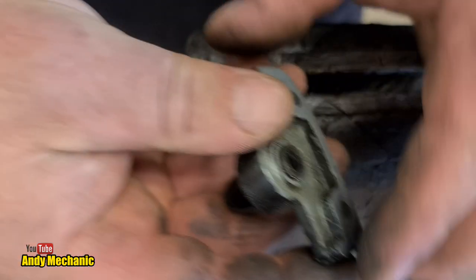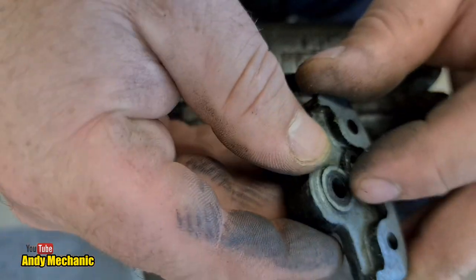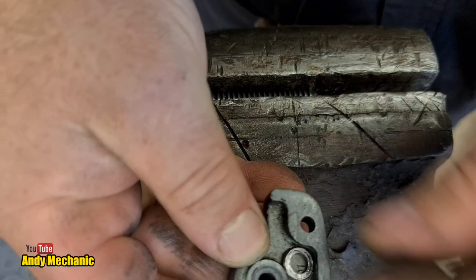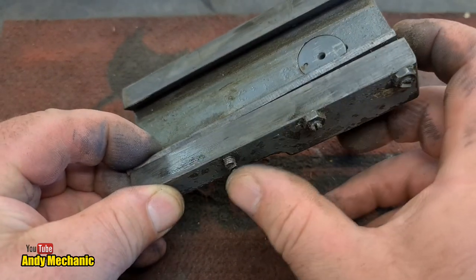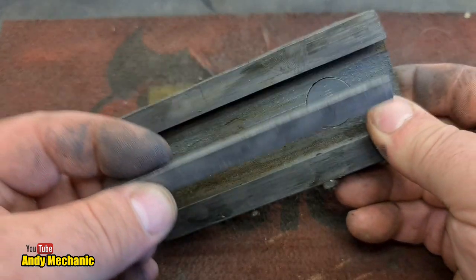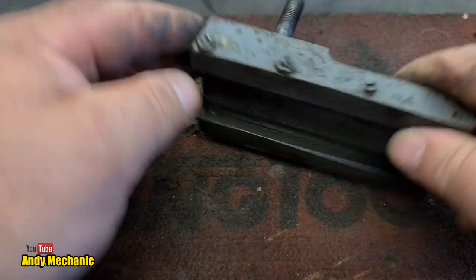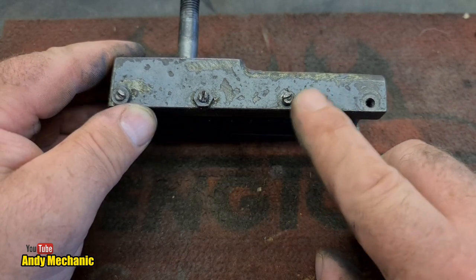Now we can get rid of this. The washer goes here - a little thrust washer - and it looks like a bush. Another washer, straight into the casting. Just before we move on, I want to take a closer look at this slide. You can see this bit is the adjuster - basically these little adjustment bolts here. You can apply more or less pressure to this plate and take up any kind of play on the slider so it's not wobbling around - nice and accurate like it should be. The slider looks to be in pretty good nick. I need to remove each of these screws - one's completely missing, this one's lost its lock nut, and these two are looking pretty rough too. So I'll maybe order four new ones of those.